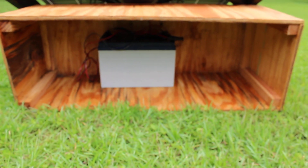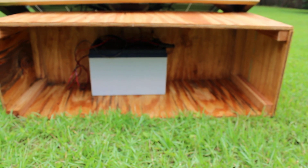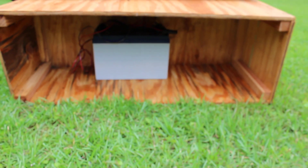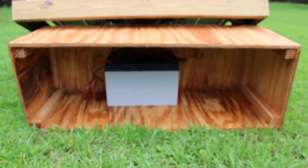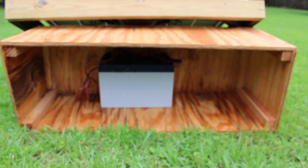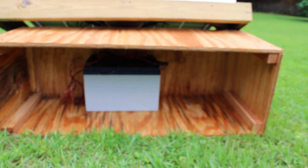I'm using a Renogy battery as well — it's 100 amp hour, a deep cycle battery. I'll show that a bit more and do some more testing on that. I want to do several discharges on it to really see what the actual amp hour rating really is. Most of the time they're overrated, so we may only have 80 amp hours in this battery. At 100 amp hours, a 12-volt battery is 1.2 kilowatt hours. So we'll do some testing on that.